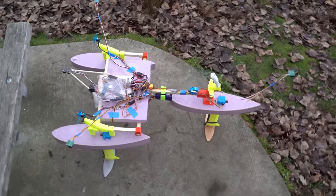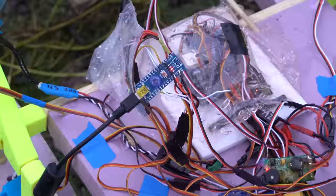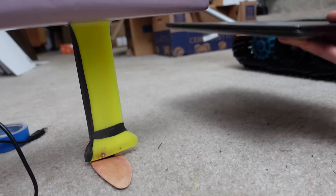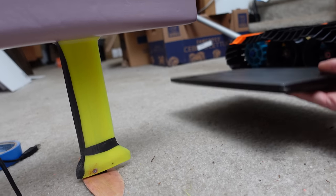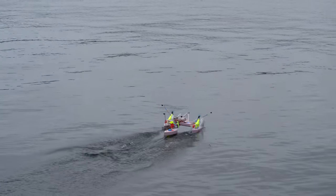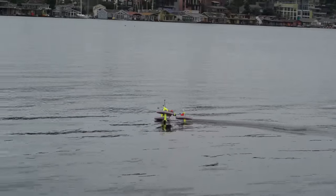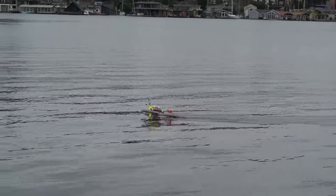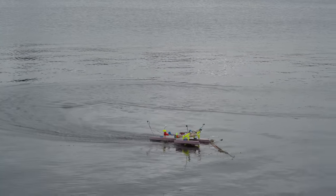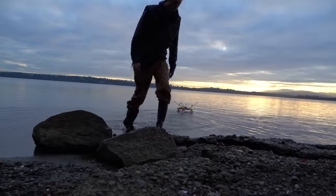But I did get around to trying out one rangefinder for each hydrofoil. I'm using an Arduino Nano here to read each sonar distance and adjust each servo position proportionately — no IMU or ArduPilot, just rangefinders. On the first day of testing this, I did not have any luck. The next day, I adjusted the servo endpoints and proportional gain, and this actually seemed to work.